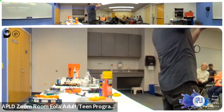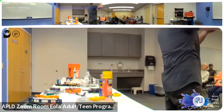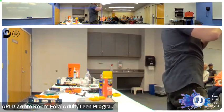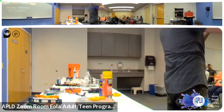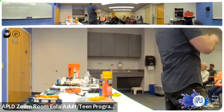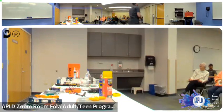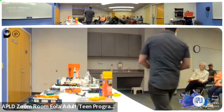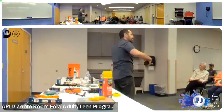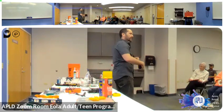But what I do want you to see is this. Okay, this right here. The ends, they move. They're supposed to. Your tape measure's not old. Your tape measure's not broken. This isn't poorly manufactured. It's supposed to move. It wiggles the thickness of this piece of metal. And the reason for that is, if I'm going to come over here and measure the inside of this doorway, that thing will push in just a little bit. And then when I take it back over here and measure from the outside of a piece of wood, the tape moves just that thickness so that everything's just right.